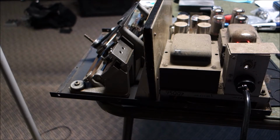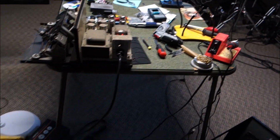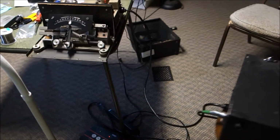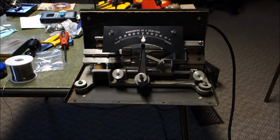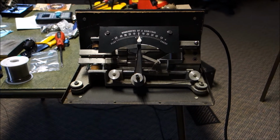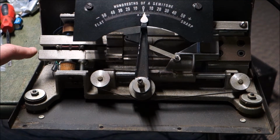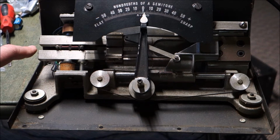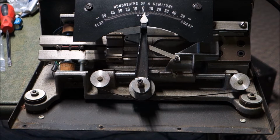When I first initially fired this device up, I did not get a pilot light. The tuning fork at the front. Let me walk around so y'all know what I'm talking about, because if you don't know what these are, then you don't know what we're even doing. Hopefully you've seen them on other videos on my channel. So here's that. Right under here is a tuning fork, and it is actually singing at about 55 hertz. There's an exciter coil and two pickup coils on this that are used to create 55 hertz AC to run the motor.